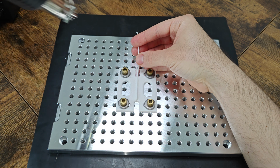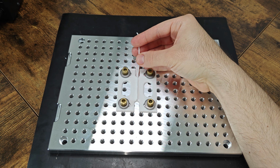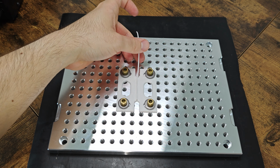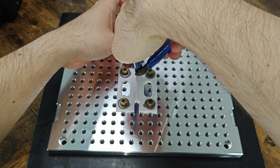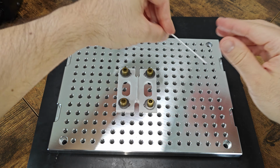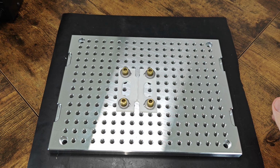We're almost to the fun part. Most of your heat control is actually coming from the heat gun. We have the soldering iron heated more so the plastic doesn't instantly solidify when contacting it. If we tried to do this with just the soldering iron, either the plastic would burn, or you would have to say goodbye to your loved ones like you're going on a 6-month deployment to weld plastic in the Middle East. In case you didn't get that joke, it would take a very long time and would be very frustrating.